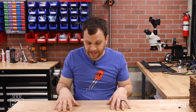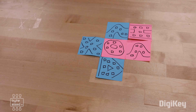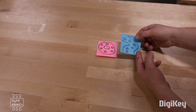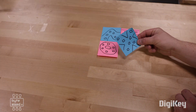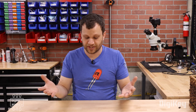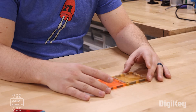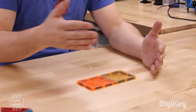Here's the overall plan. I'm envisioning a whole bunch of identical tiles, and each tile has some LEDs on it that are interactive. As each player takes their turn, they'll place their tile down onto the board, and depending on how and where they place it, the LEDs will respond accordingly. Now the question is: how are these tiles going to communicate with each other? I can put magnets on the tiles and they'll snap together, but there's no communication path between the two tiles, so there are a few options.